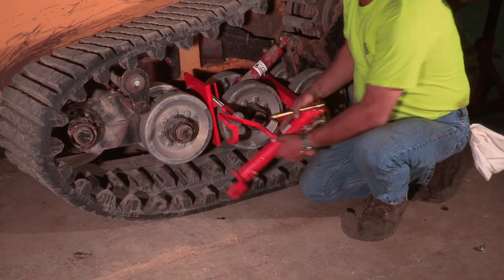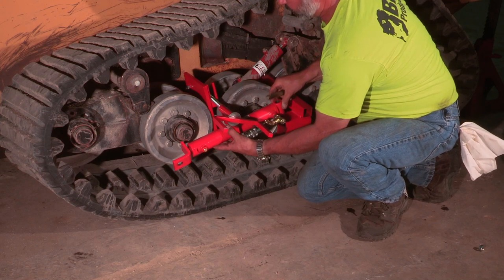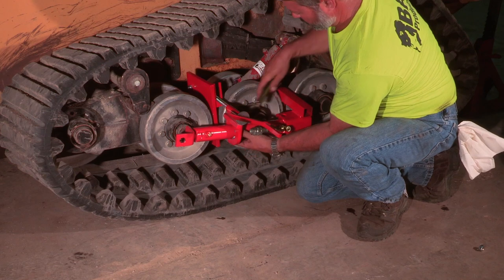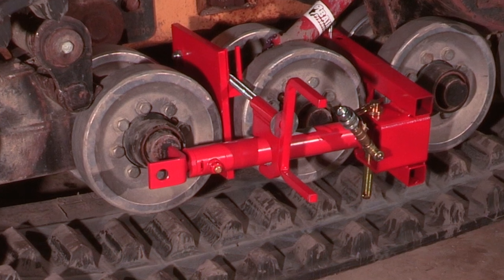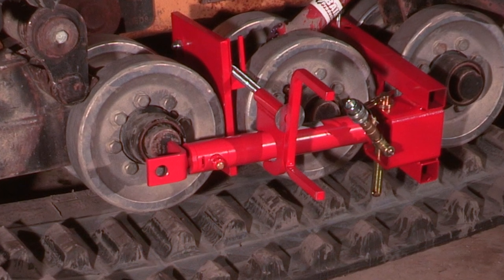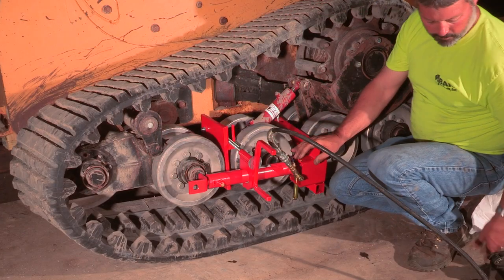What the saddle assembly does is capture the hydraulic cylinder. As we install the wheel, it starts out at an angle away from the machine. As the wheel gets pushed forward, the hand crank tilts the wheel in square with the mainframe — it's a simple one-man job to put the wheel on. Note how the cylinder is aligned. At the end of the hydraulic rod, notice the L-bracket with the hole in it. For this particular install kit, disregard the hole, which does not apply to this kit and is utilized on a different install kit for larger machines.